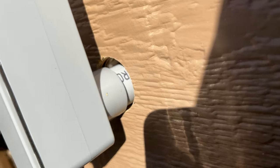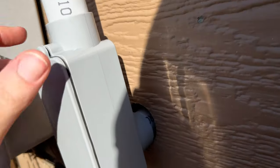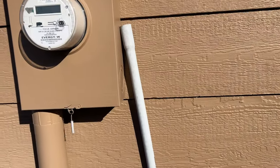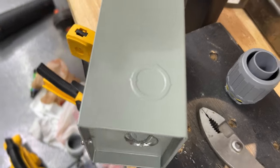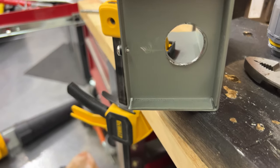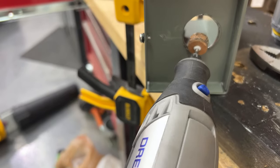Check that out. I'm going to put some sealing in there, some foam, and then some more sealing — expanding foam. So far looking kind of interesting, looks like it works. I thought a knockout was just supposed to knock out, but this one is just solid — all it is is just indented. So you have to drill it out and I don't have the appropriate size metal drill bit. So I used the size that I had and I've been grinding it with a Dremel.